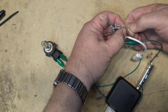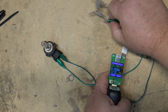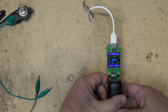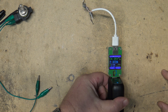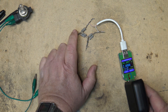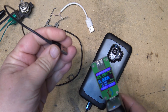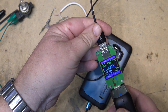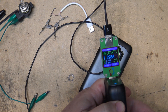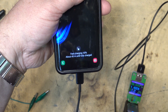It doesn't supply enough power to light up a 50 watt halogen lamp — that's exceeding the current capabilities of the unit. After all, it's only rated at 36 watts. But on the USB port it will provide 2.37 amps and the voltage doesn't drop by much, still putting out 4.95 volts, and that's going to get these resistors hot enough to actually melt solder. It's also a quick charger — if I plug my phone in it should change the voltage, going up to either 9 or 12 volts. This is QC 2.0, charging at 9 volts at 1.3 amps, so it will charge my phone up very quickly.